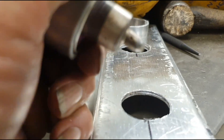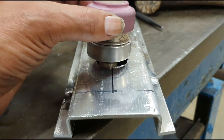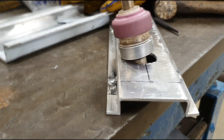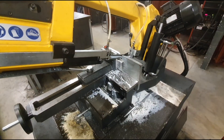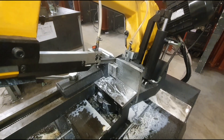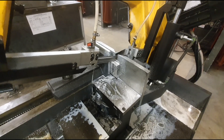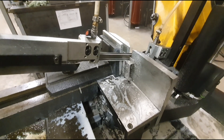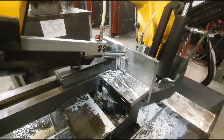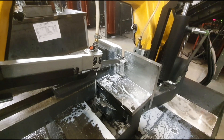If that's fully home it wants to be sitting about there, so that's the extra I'm going to work on now. It's all trial and error when you're making stuff, but that's the bit that we like. I'm going to cut the width size now of the ceramic valve housing bracket, so I'm using the band saw. I've got it set up in the vice - much quicker, a lot neater, a lot squarer. Cutting the piece up at 200 millimetres - that's the size I want to fit into the unit. Once I've got this cut, we'll weld the sleeves in and that's more or less completed this stage of the amplifier upgrade.